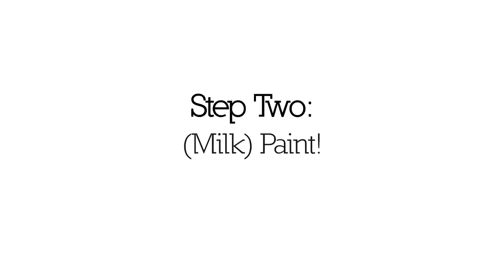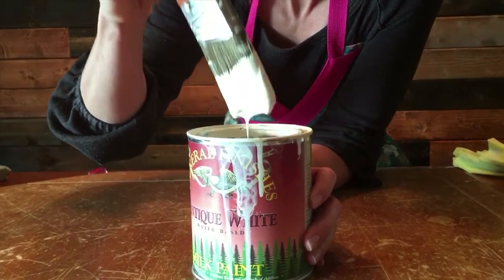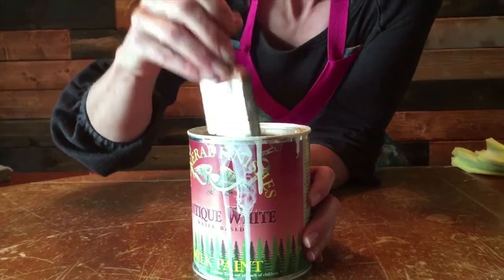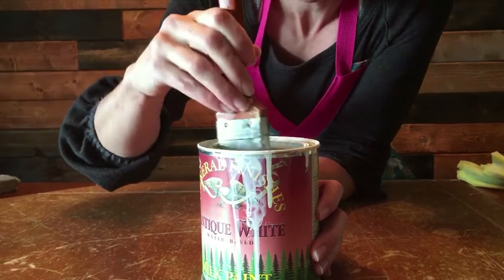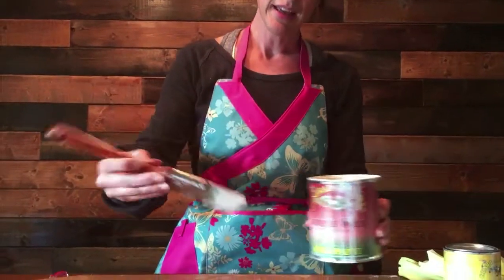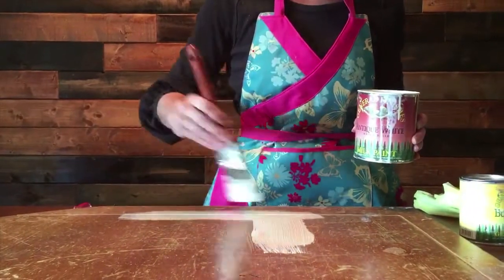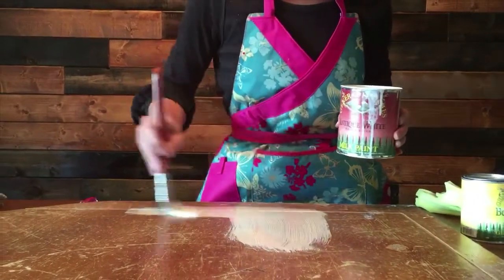You could even take a damp washcloth and wipe it. Now we're ready for paint. Usually you want to brush on one to three coats of milk paint depending on what you're doing. Today we're using antique white. When you open the milk paint and mix it, make sure it's stirred really well. You want your milk paint to run — it comes a little thick. I always add water. That's the nice thing about milk paint: it can be watered down. I'm going to go right with the grain — just look at how it layers. It works as a primer, it does not have a strong odor, it's literally made from milk.